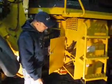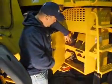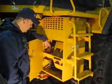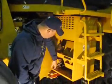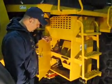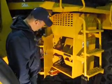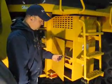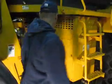And right in here they got a lock compartment, and it's got your accumulators for your braking system. It's got some pressure ports for checking pressures, and there's some wheel chocks in here too to block the tires with. And then there's some other pressure gauges and stuff in there. We'll keep those in this compartment.